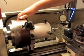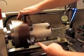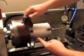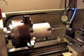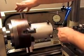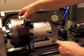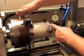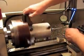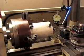Then you'll run the dial indicator further down the rod, see what the runout is, and adjust the four bolts on the jig on this end. You just have to keep going back and forth. When you adjust the four bolts here getting this end running true, it's going to have a bearing on the other end. So you have to constantly go back and forth — adjust one end running true, then adjust the other — and keep going until it's running true throughout.